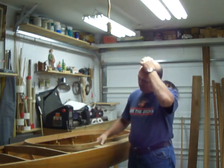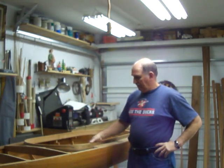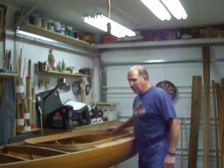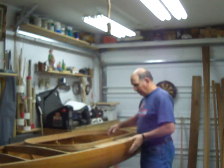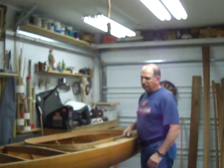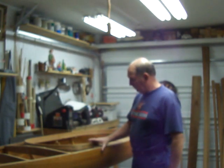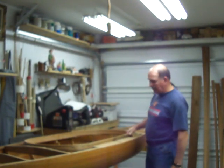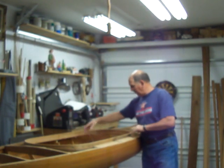I've been working on this for a while now and had quite a few problems. I didn't know how I was going to put this gunnel in — it wasn't perfectly oval; it was a little narrower at one end than the other. So I'd mount it, measure around the sides of the boat, and nail it on each end so it would rock. Then I measured off the corners, got them all equal, clamped them, and nailed them. I stretched it over until we got the same amount on each side and nailed it.